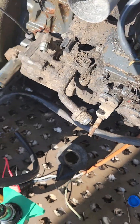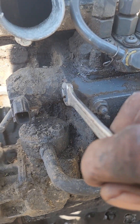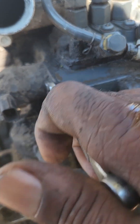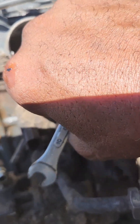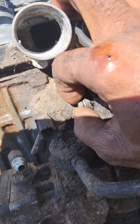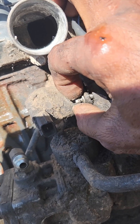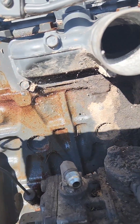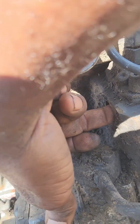What I'm going to do now is remove the fuel shutoff solenoid. With the solenoid installed, it will not produce any diesel until it's energized by 12 volts. So if we remove it, the fuel will flow through manually — you won't have to apply 12 volts to activate it. So I'm pulling it out. One of the bolts was already missing. There are 10-millimeter bolts, two small ones. Almost all these diesel engines have them, even the bigger ones. When the engine starts, to cut it off, stick your finger in and push down — that cuts off the fuel.